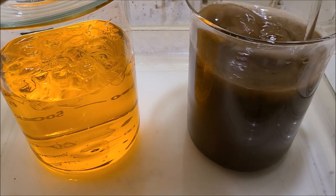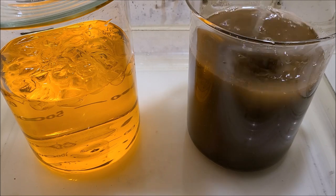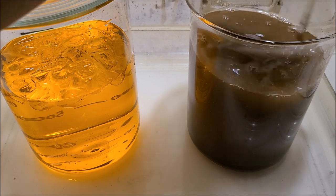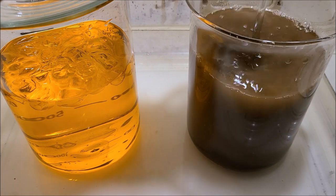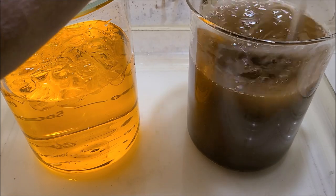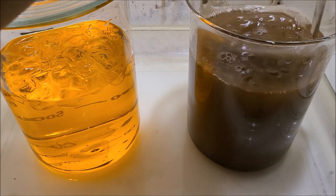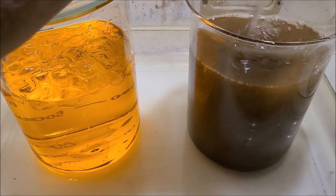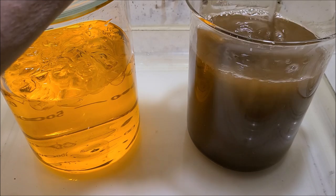But I wanted to keep, since this is an exothermic reaction, it gets pretty hot. If it gets too hot, it tends to make the gold stick to the edge of the glass a little bit, to the beaker. No matter how clean I get it, it still seems like it wants to bond sometimes if the temperature's too hot. So